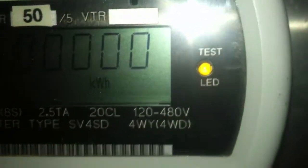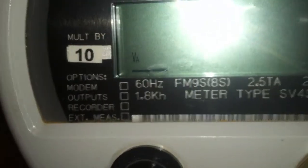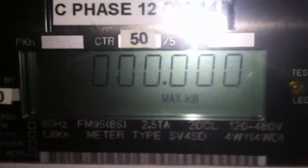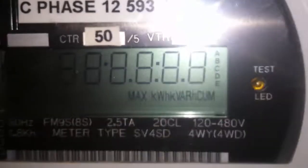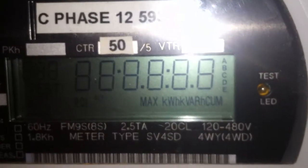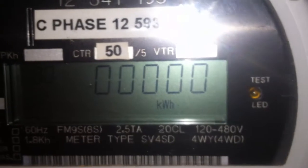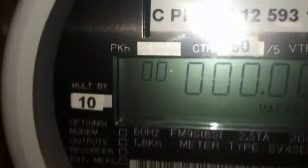There's a test LED — there we go. I do have a wireless modem installed in here; that's what it keeps doing, it's flashing the kilowatt demand. It's sending off a signal. It goes into a test reset, and then that's the kilowatt hours. This is a new meter, and you can have a digital recorder inside it.